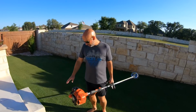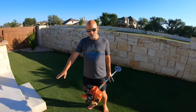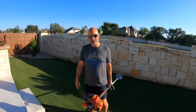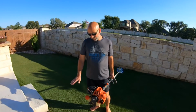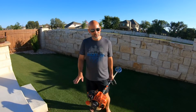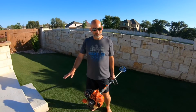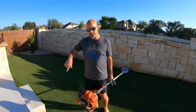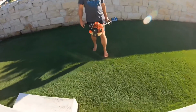So I just finished this little demonstration area, and it got all the way up into that corner at a 90-degree angle. What's also really exciting about this is how I can match the height of the mower. The reel mower right now is set just below 6/10 of an inch, and I can match that identically with the landscape blade, whereas it's very difficult to match that with a swinging string. So we'll take a closer look at that.